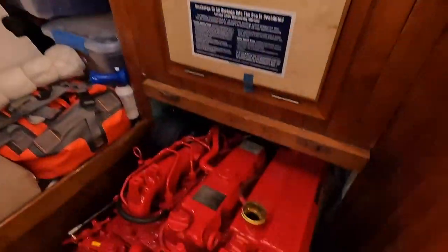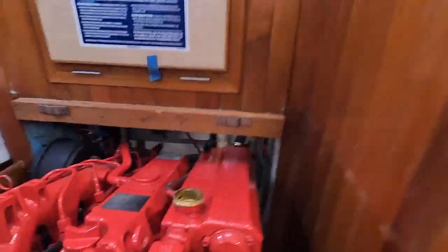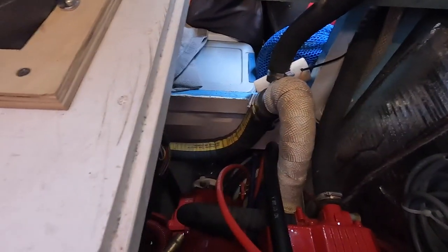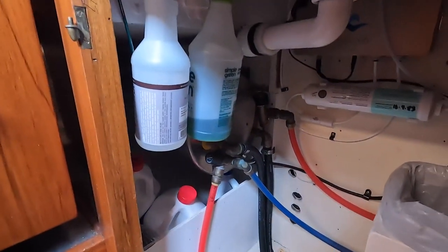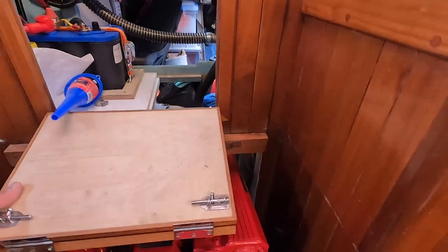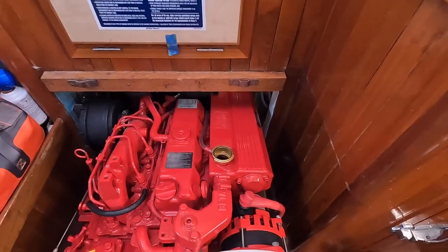I need to bleed off the coolant and get the air bubbles burped out. I've got this one — the return — hooked up to the bottom of the heat exchanger, and the one in the back is loose. I'm going to take a little funnel and try to fill up some of the area inside the water heater. There's a procedure outlined in the Beta Marine manual: fire up the engine, let it come up to operating temperature, top up the header tank, evacuate air out of the system, then check that hot water is being made and make sure the engine doesn't overheat.